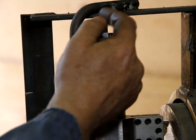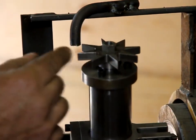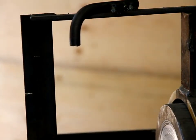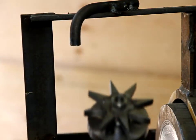It's important to have your tab welded in a position that clears the approaching tooth but strikes the furthest forward tooth. So that as it comes around and advances, it misses but it strikes just the one tooth.